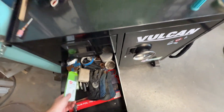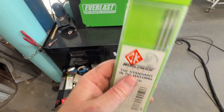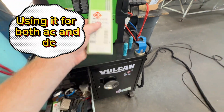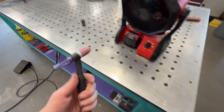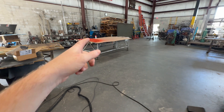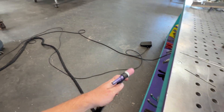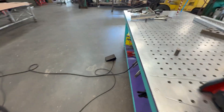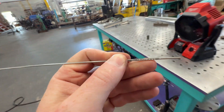The tungsten I've been using is CK Worldwide laser tungsten. I've tried it out — I like two percent lanthanated blue, but I like this because you can run it on AC and DC. Nice to have one color tungsten instead of a bunch of them. It even works for transformer machines. Big thing: make sure you grab type 316 wire and that your wire says 316 on it.